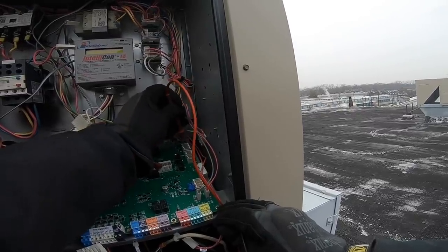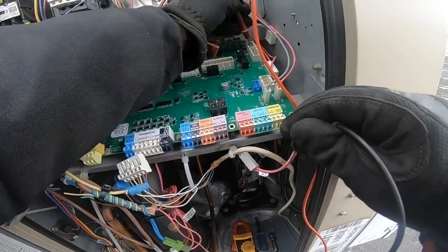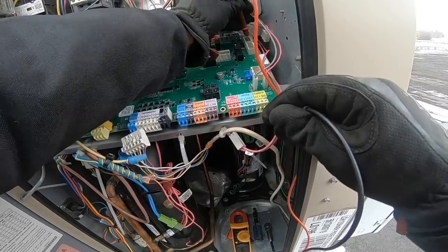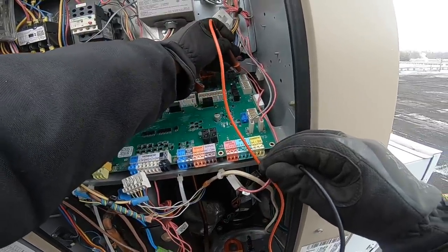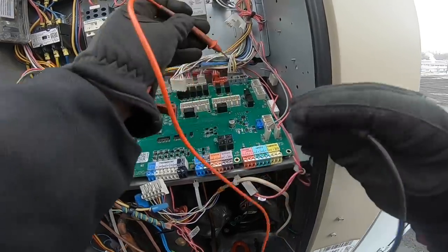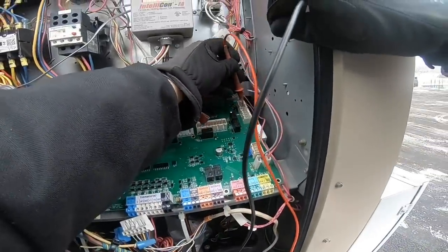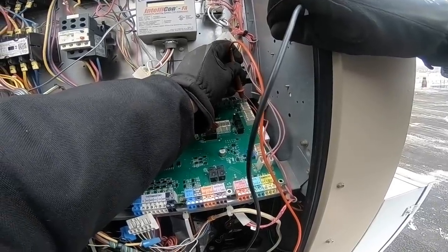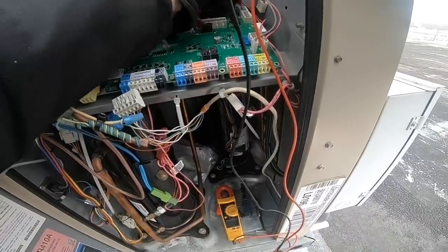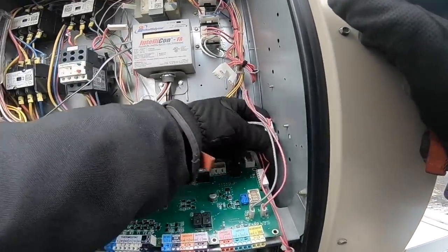Okay. Top is not grounded. High resistance, but not grounded, where before it was a direct ground. Second one, open line. Those are my reds. Of course, the grays will be grounded. That one's not. This was my failure, so. High resistance, but not grounded. Grounded, that's my common. Open line. Grounded. Open line. This board's good. No direct shorts.